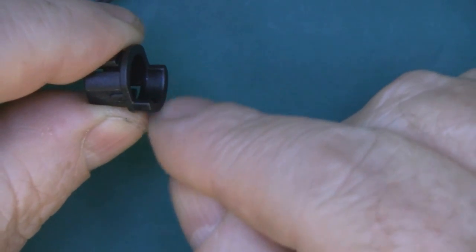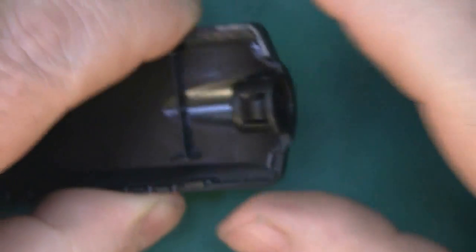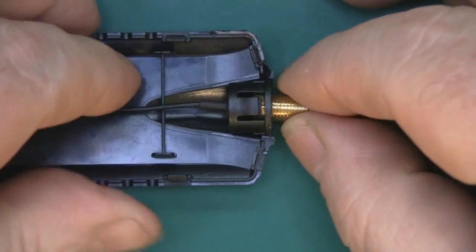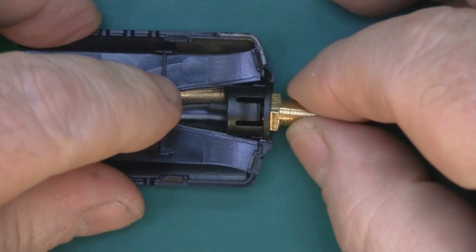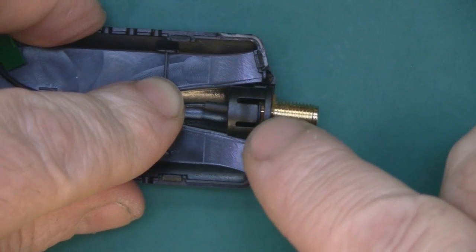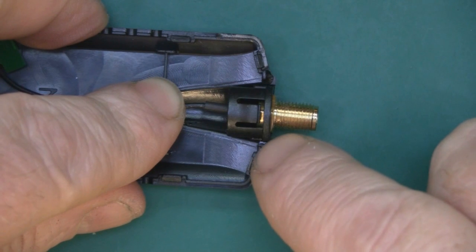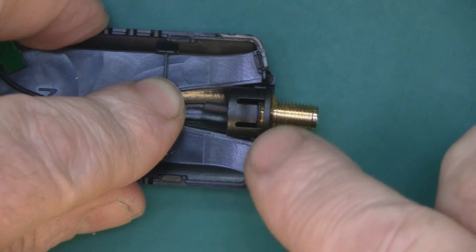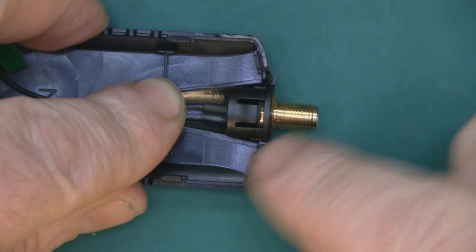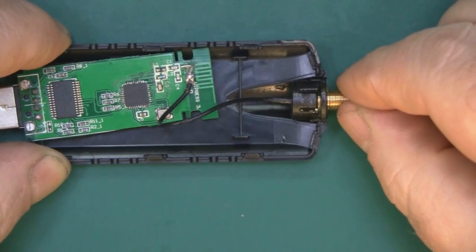I need to trim this lip off as well. I've super glued that outer ring down to one side of the base and I'm going to feed the SMA connector through. It's quite a nice tight fit but not quite tight enough, so through these little slits I'm going to drizzle a small amount of epoxy and let it dribble down using gravity onto the SMA connector and the inside of the ring. The epoxy has set around the bulkhead SMA — it's really really solid, it's not going anywhere.